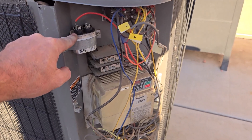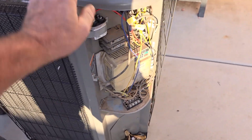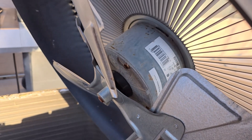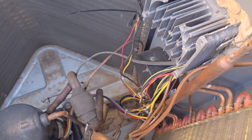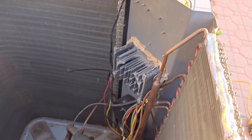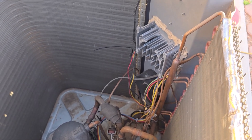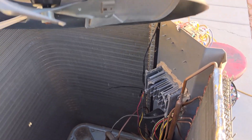This capacitor hasn't been hooked up because I took out the single-phase split capacitor motor. I was running an ECM, but you see this is all an experimental unit. That's an ECM with the module separated - the module was put down below my VFD. The reason I put it in there was because you couldn't actually put DC power directly into a regular ECM module, just like you can with the variable frequency drive, and I was experimenting a whole bunch.